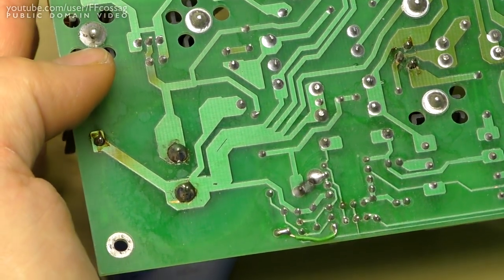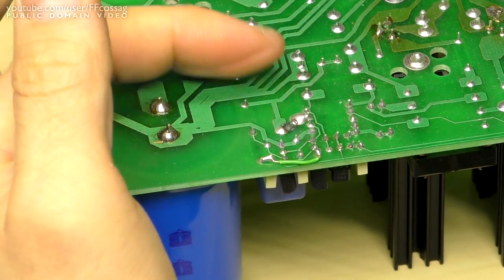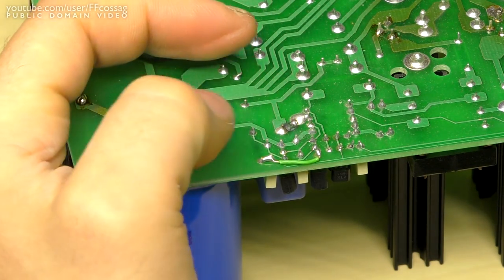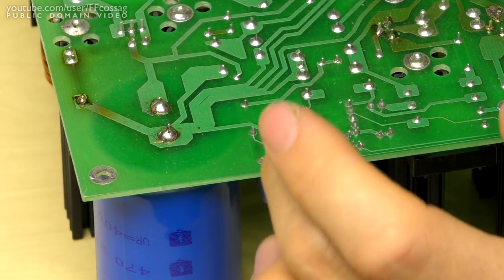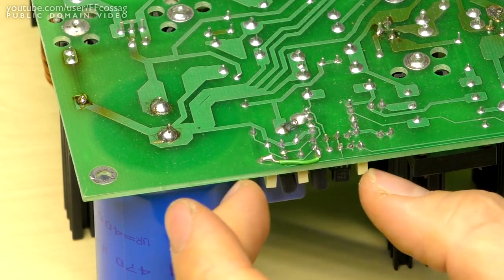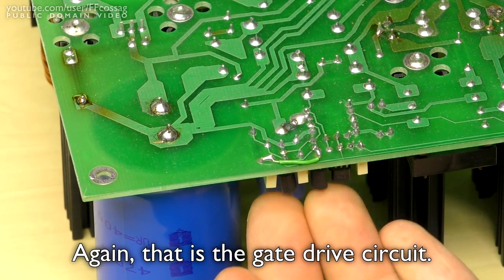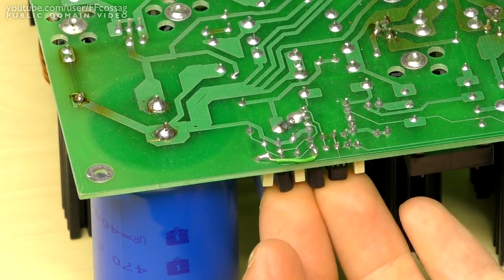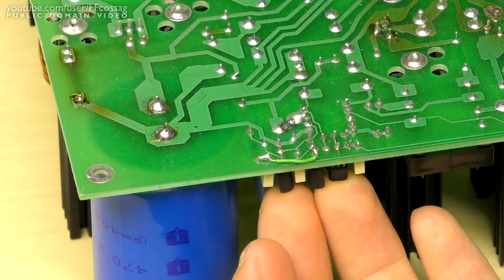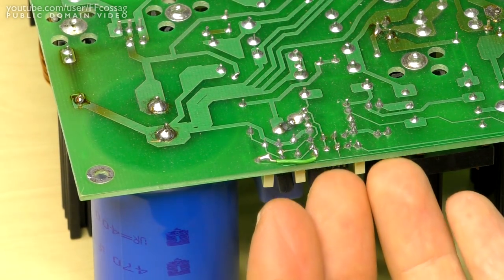In case there's just no actual fault in the capacitor circuit here, which, like, if there never was an actual overvoltage here, but just something coupling that high voltage into the PFC control circuit, would be a good thing, because then we would just have this hopefully simple fault where we've just had a huge energy discharge in some devices that are not made to handle it.